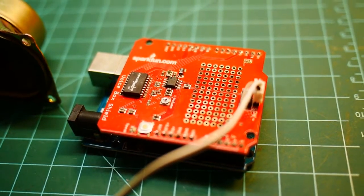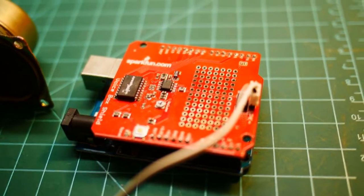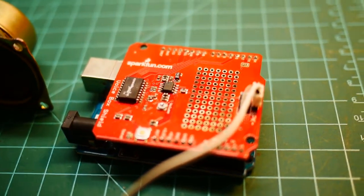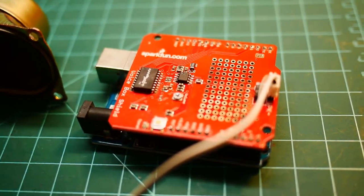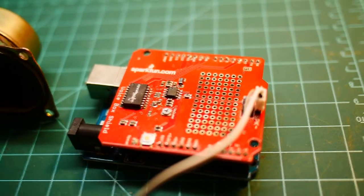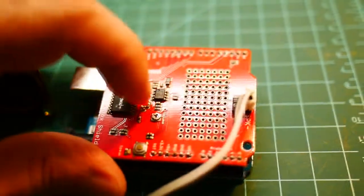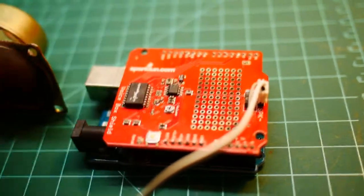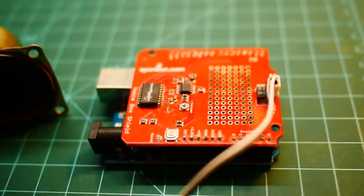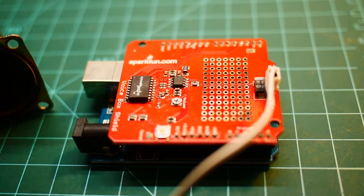which I believe is just a PIC processor that has some basically recorded phonemes in it. It is a phoneme generator, but I think they're sort of recorded into ROM. It doesn't have a lot of filtering and things like that, so it doesn't try to do glottals and all the fancy things. But it is a nice little board. It has a built-in amplifier so you can hook up a speaker. I'll give you an example of it talking.